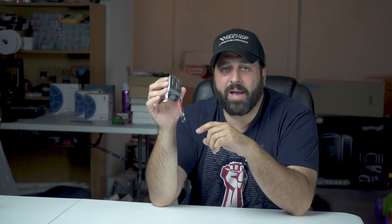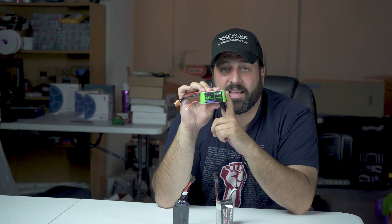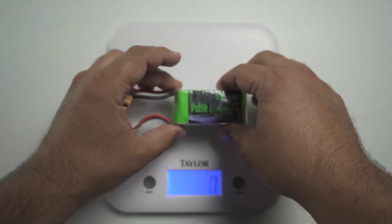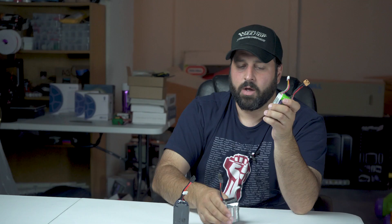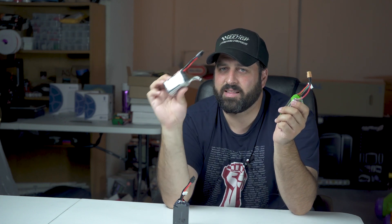I threw it back on the charger and it read about 967 milliamp hours put back in, which tells me my current sensor calibration is relatively accurate — this pack just has way less capacity than I need compared to the Pyrodrone packs. I did throw it on the scale, and it did weigh 196 grams as advertised. My primary go-to 6S pack weighed in at 219 grams. I also have the original 6S pack I used to fly — the Pulse 1050mAh 75C — which came in at about 187 grams, about 9 grams lighter than this Infinity pack. In my testing, the Infinity pack pulls a little bit harder than the Pulse pack, but the 1050 Pulse probably has a little bit more capacity than the 1150 Infinity, which I did not expect at all.